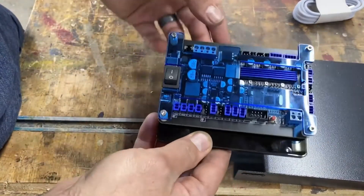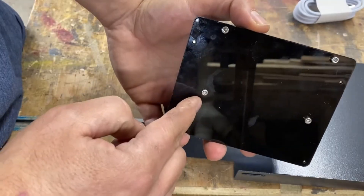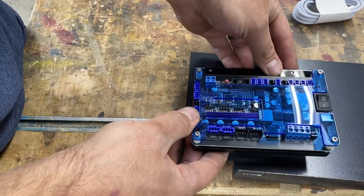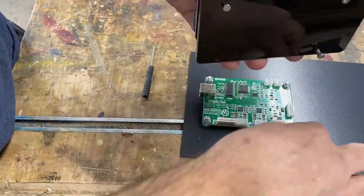Included with the controller upgrade kit is that small bag of tools with a small wrench. Use that wrench to pop the nuts off — they come off real easy. There are two down low and one up high. Once you loosen and pop those off, wiggle the bracket and it will come out with the old controller. Here is the new controller — it looks quite nice, and on the back there are four bolts. You'll just replace it the same way, taking the old one off the bracket and using the bolts to tighten the new one back on.